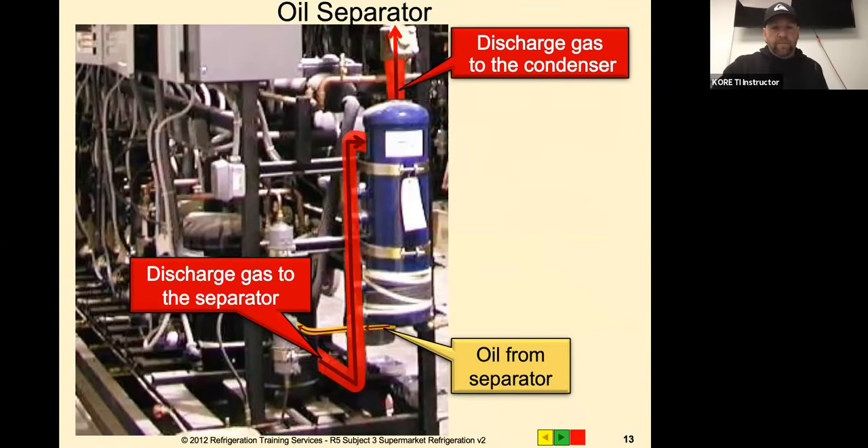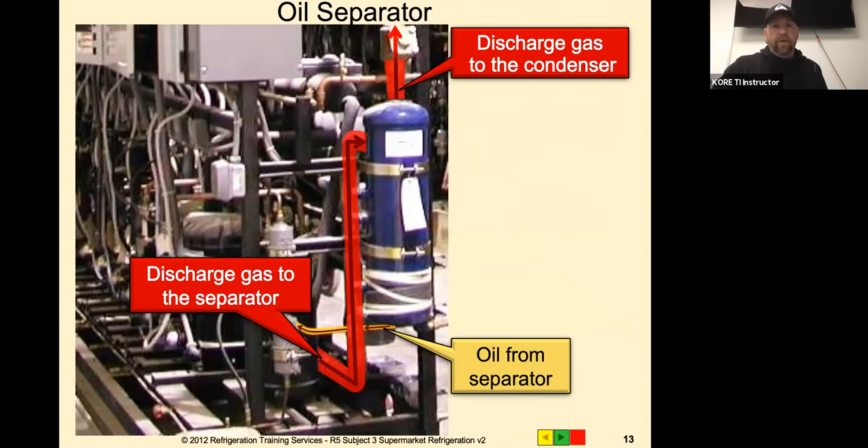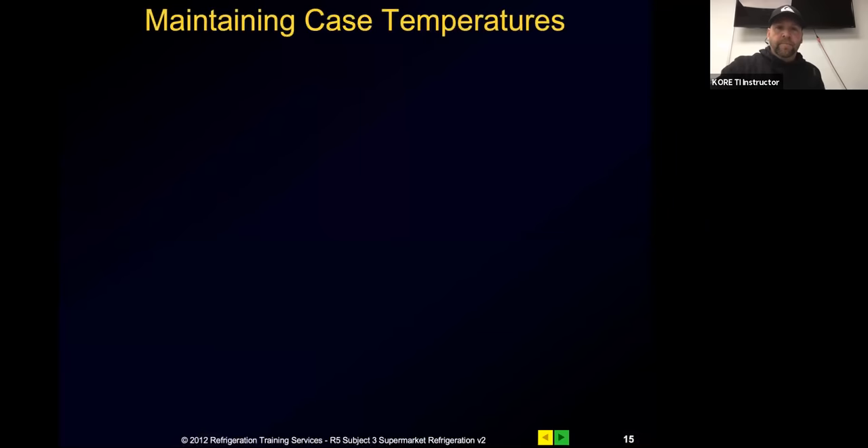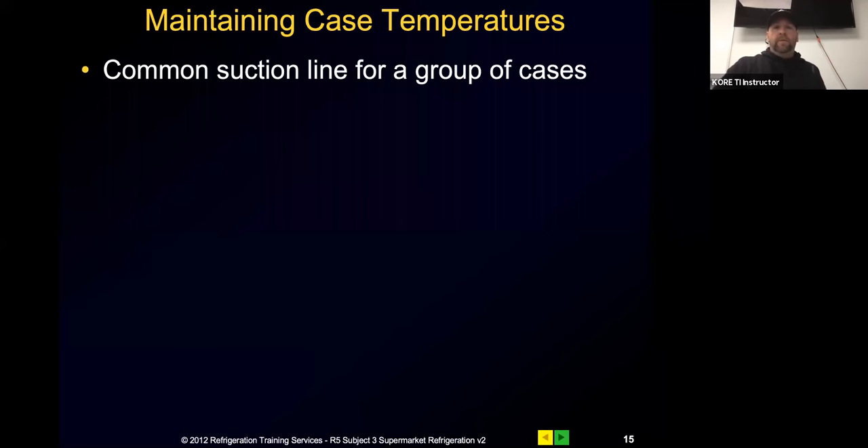Here's the float. Julian, see that nut at the top - that's where you take the hex off to make your adjustment. To Sean's point, make sure it's small adjustments and don't get on it too hard or you'll drop that float right into the bottom of that canister.